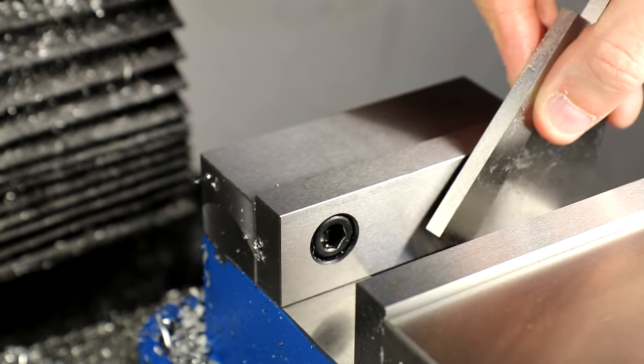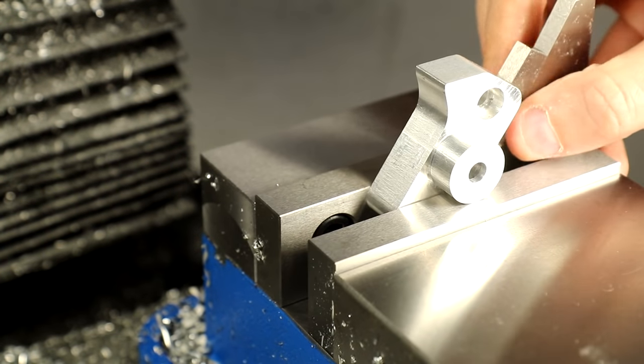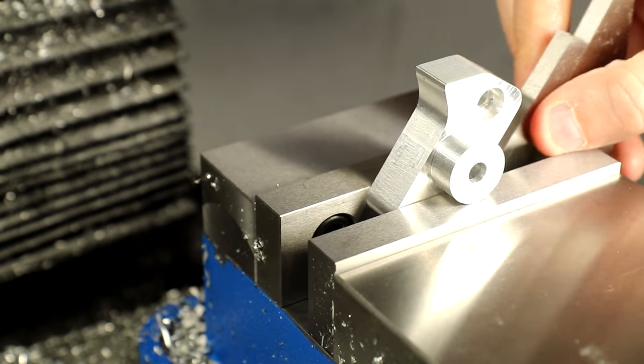The third setup is to drill a hole for the plunger switch and start by placing the bottom of the part against a known angle created by angle blocks.